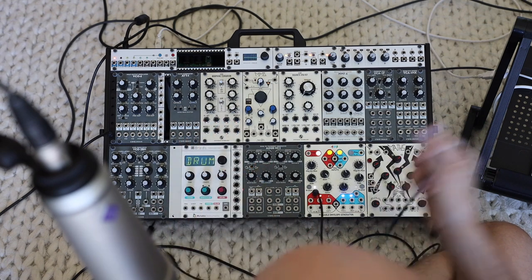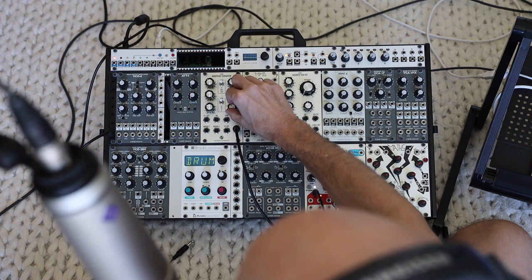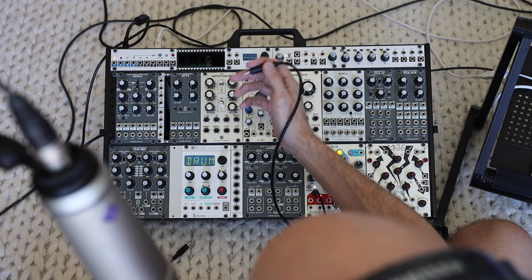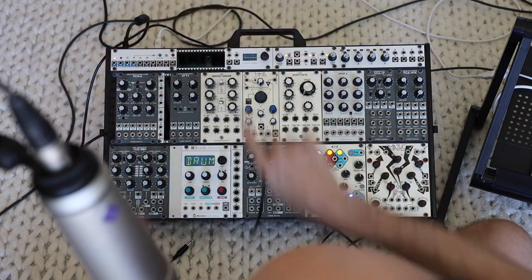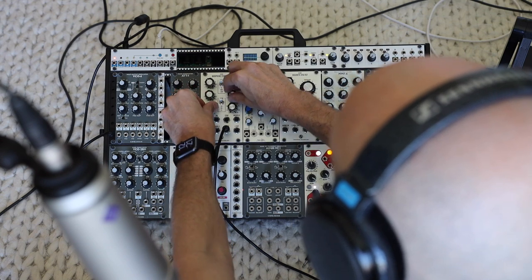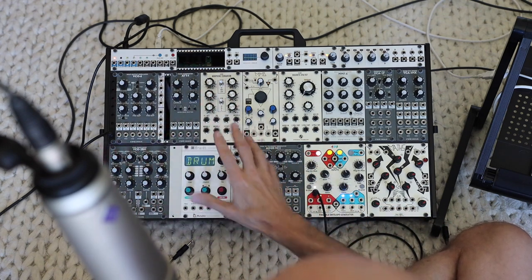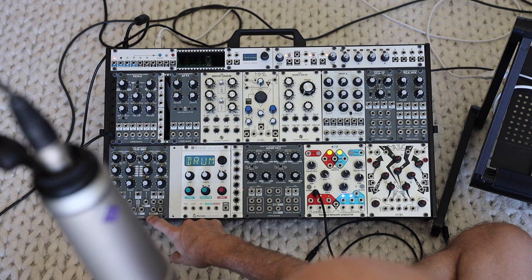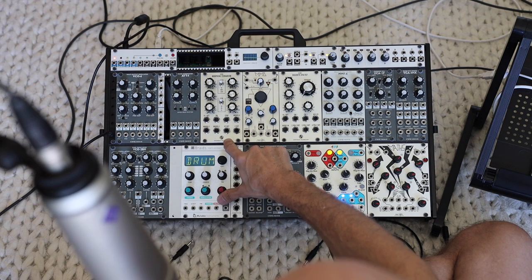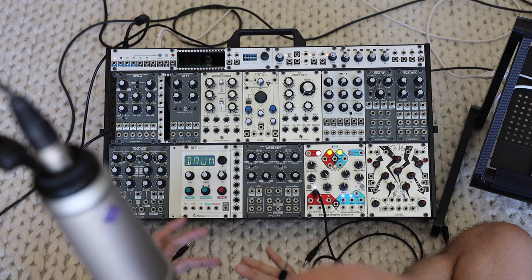There are a couple of digital modules. I have the E350, which gives me a real wide variety of digital timbre. I can modulate this with any type of voltage I want. If I use the XY output, you can get 2D modulation — moving along the wavetable on two axes. That's great if I have a surplus of modulation sources. Any of these modules can function as an LFO. The E350's C-Bank has nice LFO shapes that, driven at very low rates, give wonderfully evolving and moving textures.